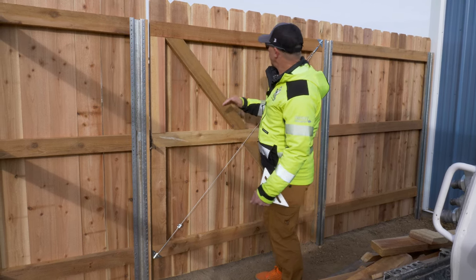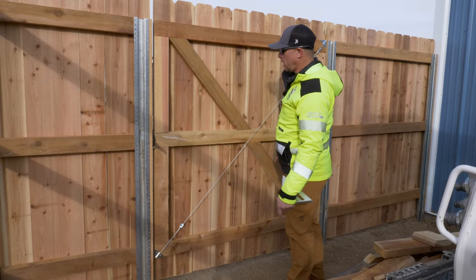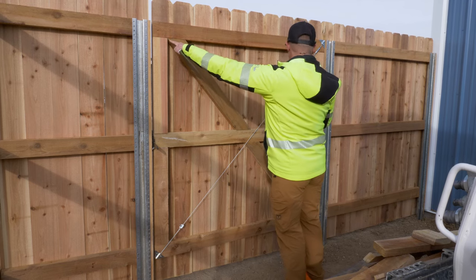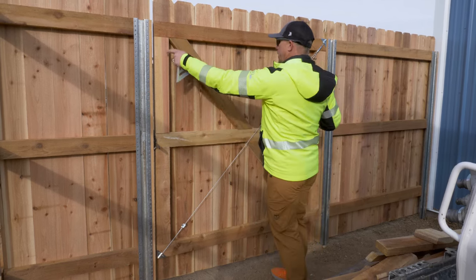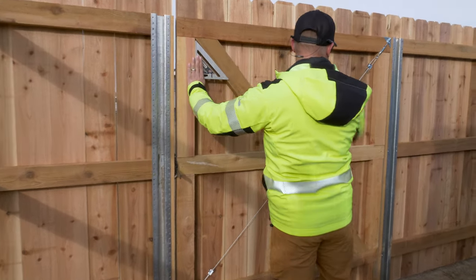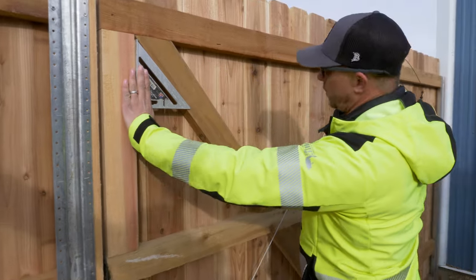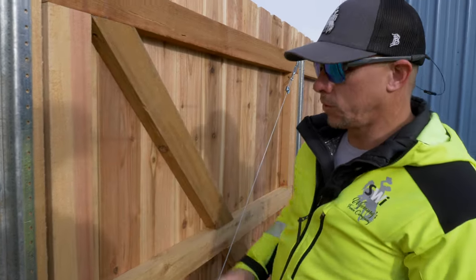What I see a lot of people try to do is a brace from here to here and then another one from here to here — that's a pretty common style. But when you do it that way, that angle would exceed 45 degrees because you'd be coming down like this, and that's a very weak brace.